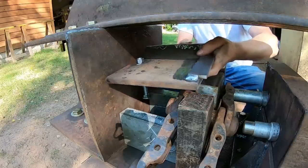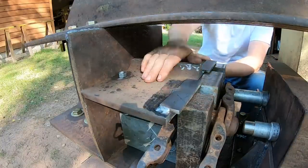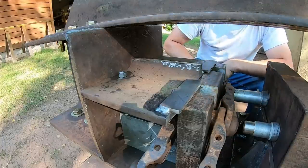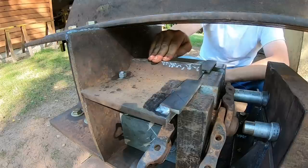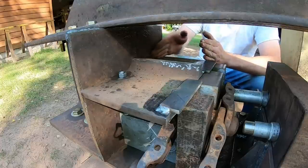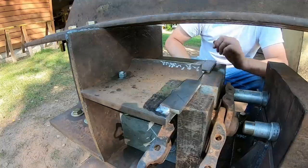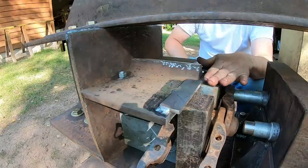I still needed this back brace to support the top of the cradle block back to the rear backstop, and I had a little bit of an end piece of scrap of that H-beam left, so we just chopped a piece out of that, cleaned it up a little bit, flushed each edge so it's fitted well, nice flat surfaces, and a couple pieces of 1/4 inch scrap just spot welded to the top so it hangs on the front.